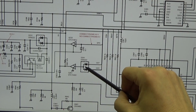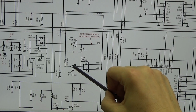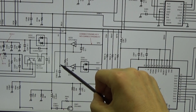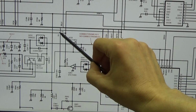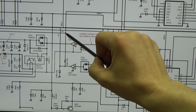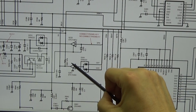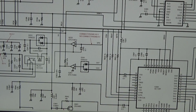Okay, and if it gets turned on by a high coming here from one of these lines, then it will switch through, and we will have 0 at this point, and that 0 is then our UL indication towards our MCU. And when we test here, of course, we have our approximately 8 volt, which we have seen, and at this point we have a low, which means that this transistor here is turned on. So that is the whole magic here.